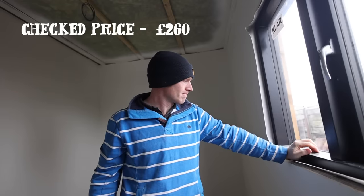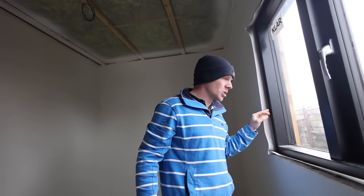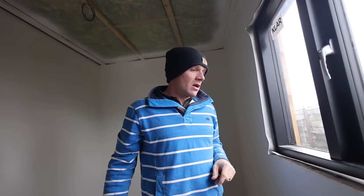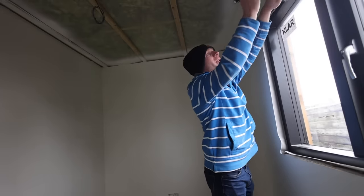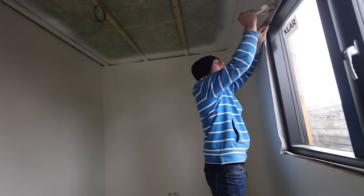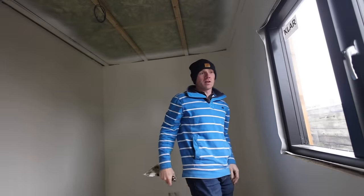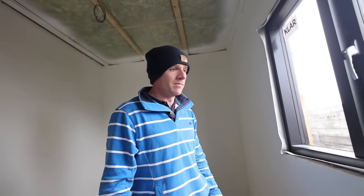The hardware seems alright. They're slightly different from typical UK windows in that they don't have that secondary locking point, but as someone mentioned we might be able to just change the plates out. For the price - these were about £200 something - no worries at all. Yes, you can paint them; I think they're just powder coated or sprayed. I'm not sure how thick the paint is - it's not enough to concern me on this building, but that's why I was thinking maybe aluminium on the next one, just because you don't know how long that paint build-up is going to last on the exposed side.